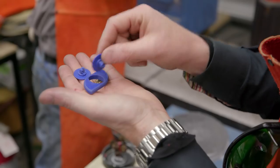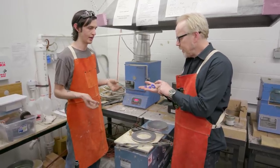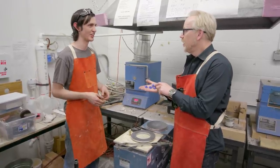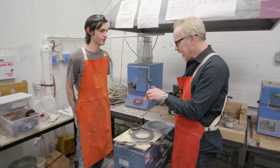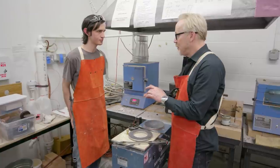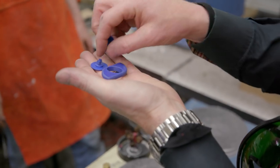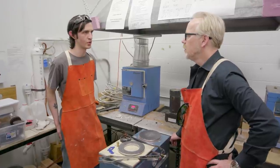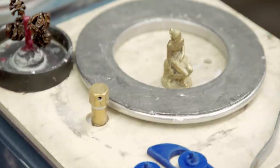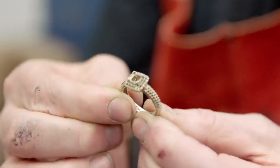Everyone's into them these days. We can take that and attach it to the sprue with a bit of wax or actually PLA. To make the PLA disappear, you throw it in an oven at about 1,400 degrees and most plastics melt. Now you're left with a void that's perfect and you fill that with metal. The 3D prints will usually be accurate to probably plus or minus 0.1 to 0.5 millimeters. You get a bit of scaling when the metal shrinks, but print your part once and take a measurement and you can scale all your other prints by exactly the same amount.